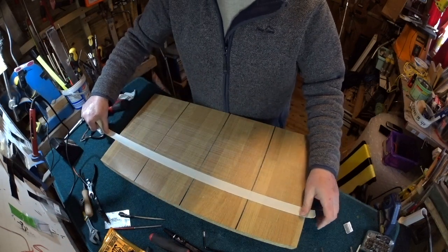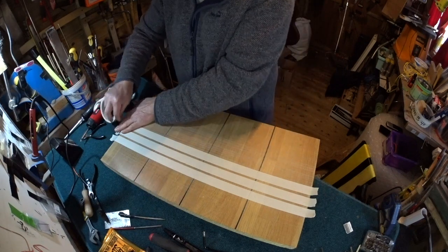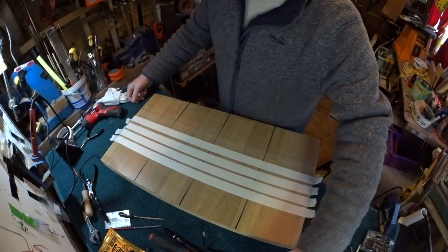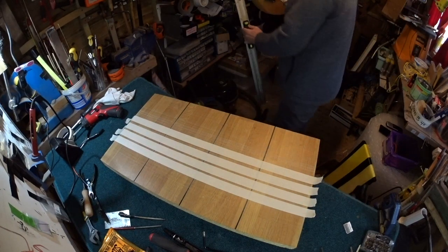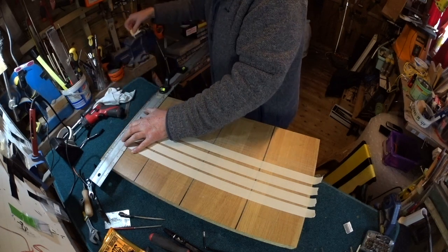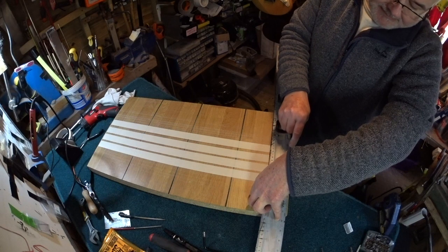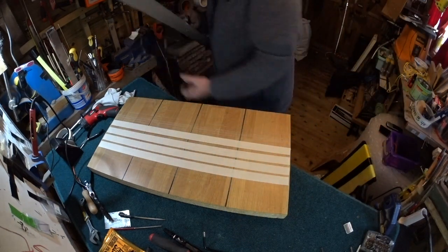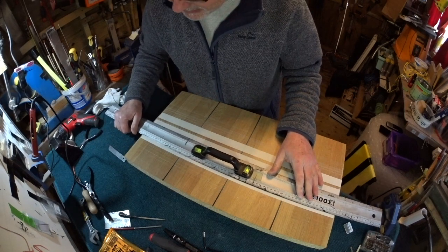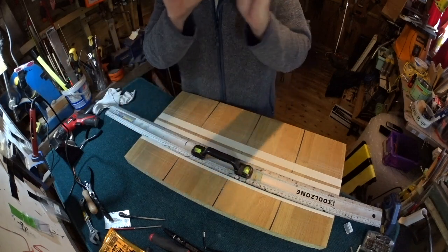That might sound confusing, a mouthful of stuff, but the point is necks are made to one of several standard scale lengths. And the reason they do that is they have to settle on an average or standard or a series of standards to make manufacturing possible. That's the first obvious thing. You couldn't just randomly choose a different neck length each time. There's a calculation based on the nominal scale length of the neck. If you say, for example, I'm making a 25 and a half inch Strat scale neck, then that 25 and a half inch measurement is an important number that goes into the calculation, which tells the manufacturer how far apart the frets are as they move down the neck, in other words, the rate at which they get closer together.